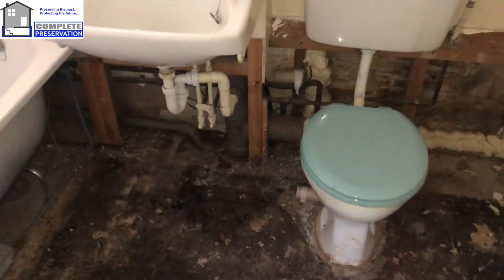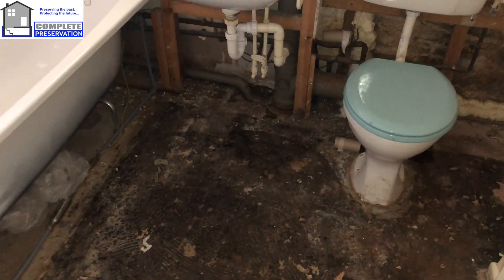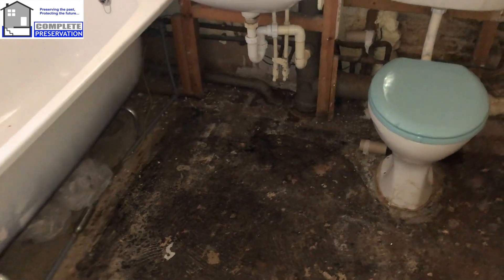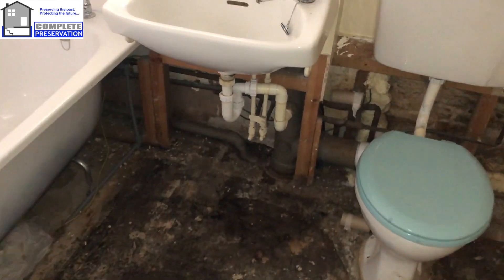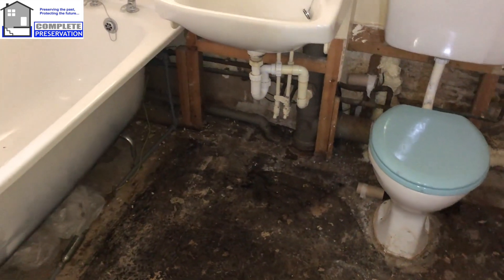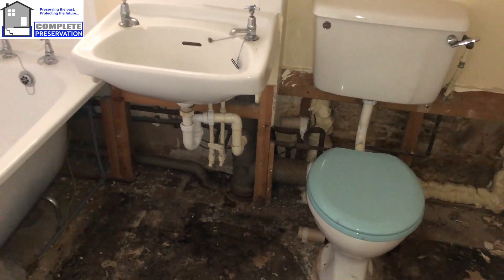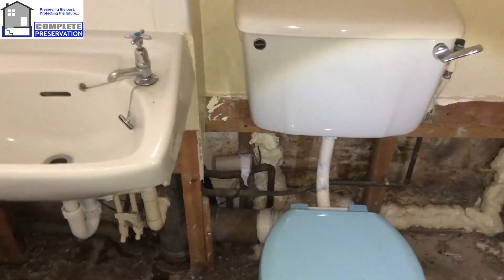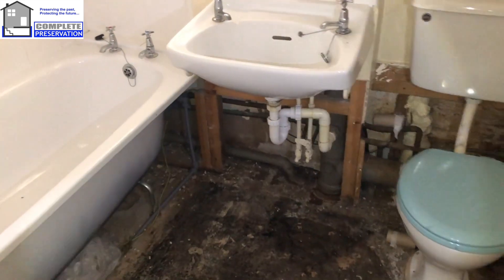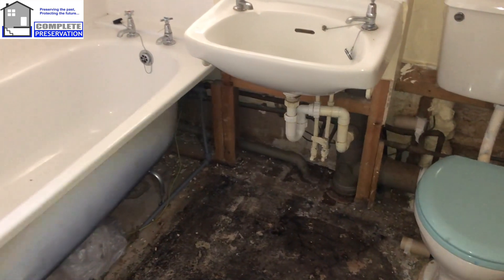Realistically, there's probably about ten problems in just this small little area. So if you're going to be getting someone doing a damp survey, make sure they're spending the time to investigate. And if they're going to be doing remedial work, you need to make sure it's the proper work that's actually needed. Because anyone just doing a damp proof on these walls is not going to fix it. What will happen is if anybody did come back, they would then blame it on a leak that wasn't there previously - but it probably was.